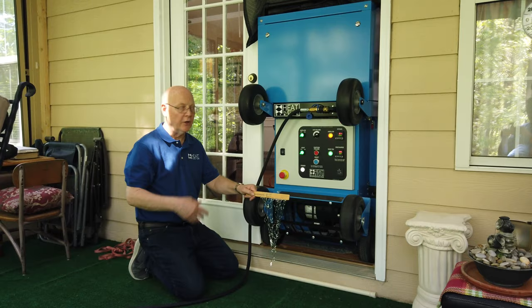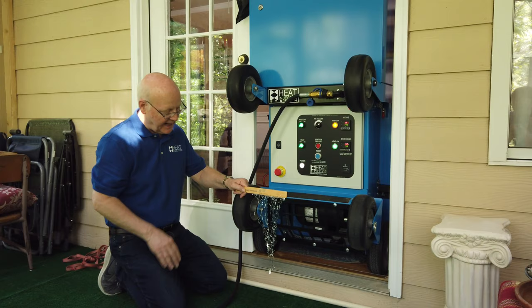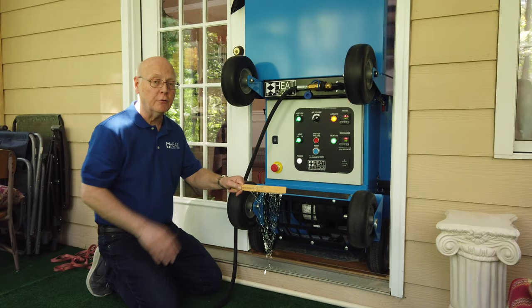As the air flows out and can no longer absorb the heat being put into the rooms, the residual heat not absorbed will go back out — that's why we measure the return air temperature at the air intake. As that return temperature gets warmer and warmer, it's saying that nothing in that house is colder than the temperature of that return air. Once your space gets up to temperature — you can tell by the return air temperature — when it gets to about 125 degrees you'd want to start to pressurize it.